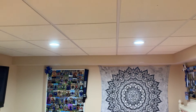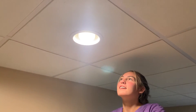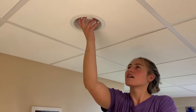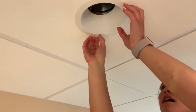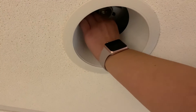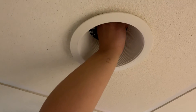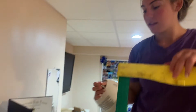All right, so there are two of those installed. Kayla, you ready to do the next one? Go for it — first thing, take the bulb out. Now take the trim ring down; there are two springs up in there. Pull up and the middle should come right out. Be careful with the next one because the ring is going to want to come off, so hold on to the spring — nice, like a natural!